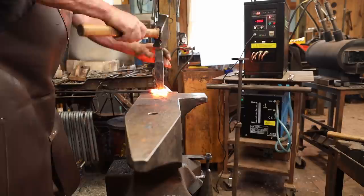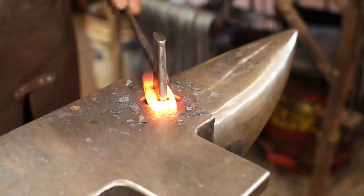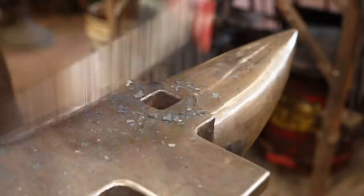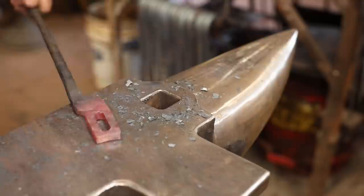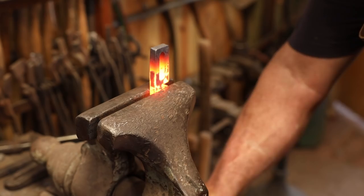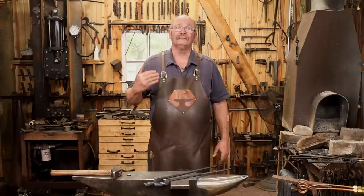It's up to what you want in your pair of tongs. You'll probably want to make three or four sets of these in different size ranges so they hold different material. The next thing we need to do is put a 90-degree twist where the jaw meets the boss. That's what the little cut in the tong blank is all about — to make it easier to do that.